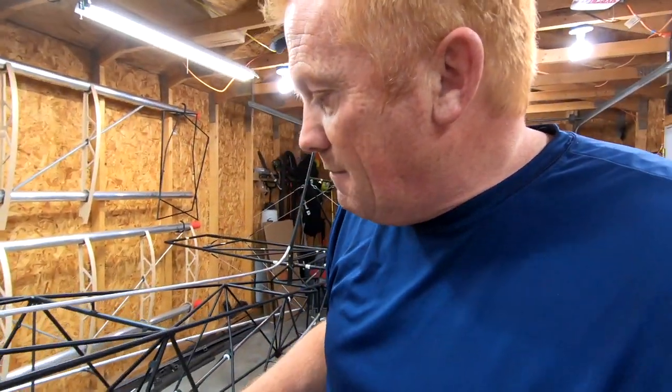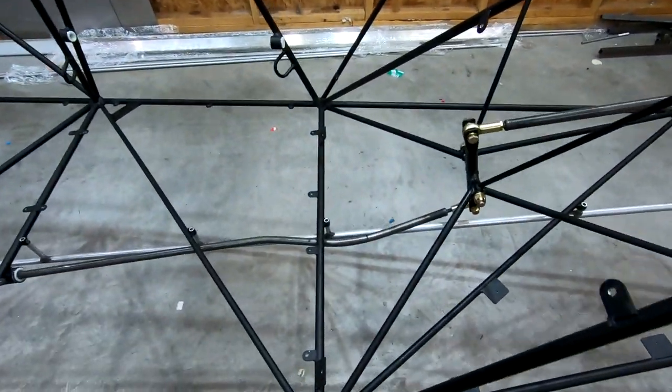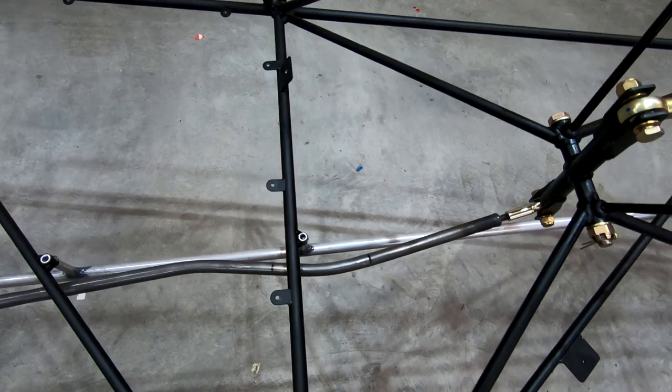So once we made those measurements, we slid the rod back out. I actually took out the nylon bushings, and then I used a small pipe bender. What I did on the pipe bender is my friend and I just kind of bent it manually around it. Didn't lock it really in place. Just bent to the mark, slid it, rotated it, bent to the mark, slid it, rotated it, bent to the mark, because you don't want to kink the tube. Then we slid it back in and made sure that we had our curve for the bell crank right here, for the elevator bell crank. That crazy curve right there, which you can see.